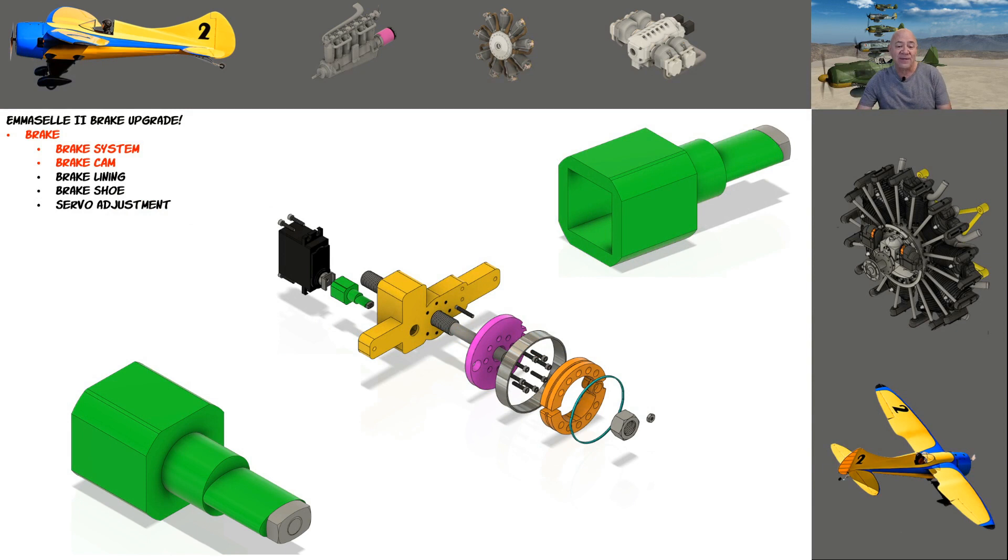The cam is right here. The servo turns and moves the shoes apart and can draw a lot of torque. I actually have a separate battery in the airplane that runs these servos. You can take the positive and negative wire off a servo and connect it to another battery, as long as the signal wire is still going back to your receiver, and it will still work. That way, if these high-torque servos jam or see a constant load, they won't drain the flight pack batteries too quickly.